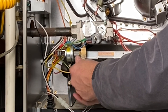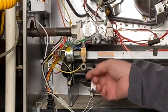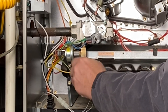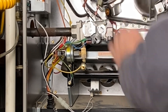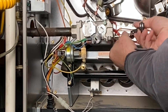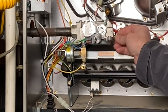We're going to use our standard service wrench — it fits that port very nicely. The Gemini valves are different, but most have this. If you take this loose with the gas on, you would hear gas coming out, and because this is propane, it would fall down and pool in this area, which can be a hazard. I'm then going to put my adapter in here and screw that in, and we're going to add a port for our manifold pressure on the output side of the combination gas valve — that's the same as manifold pressure going to the spuds and orifice.